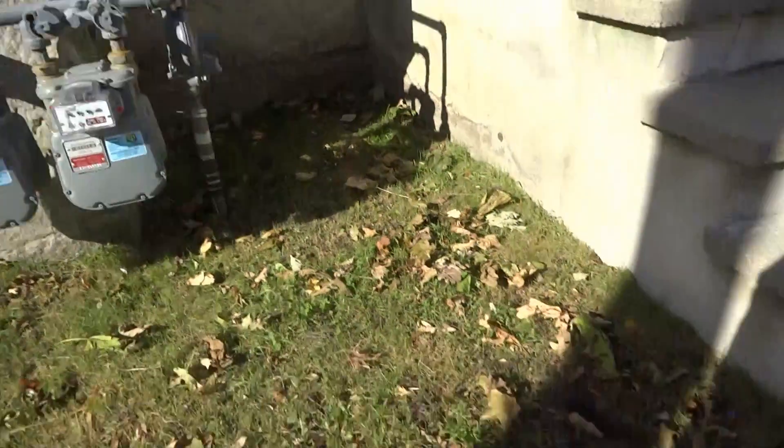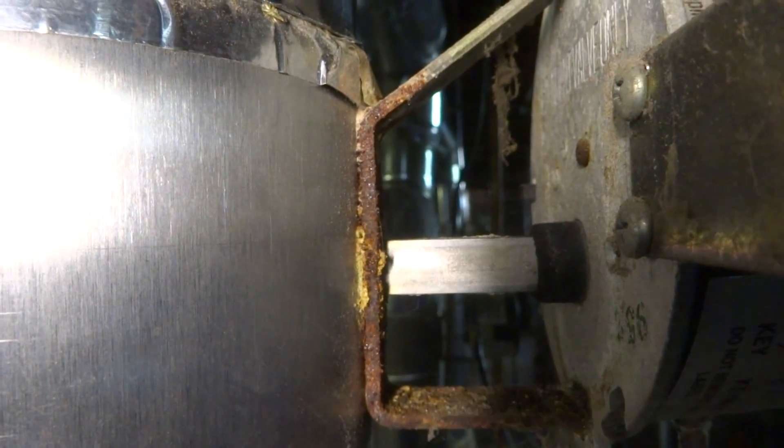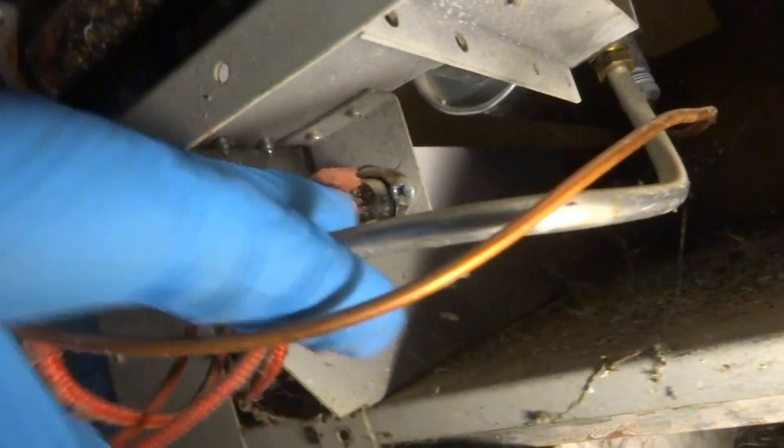Arriving on site. It's only a three-family; this is the first floor one right here. We placed them a couple back in 2014. You can see it's calling — that's open, so that's calling. Circulator's running. Probably a thermocouple that's bad — that's out, probably.